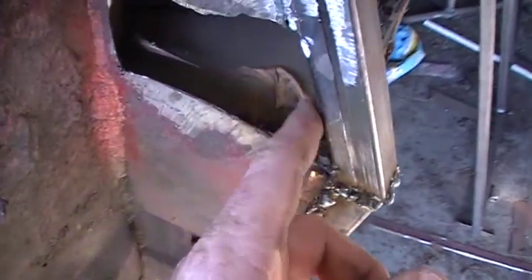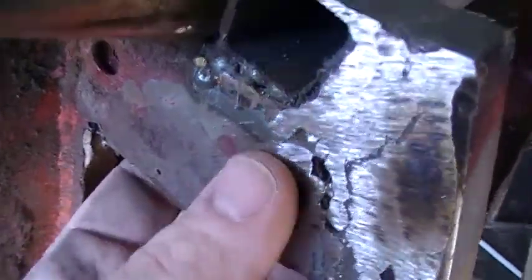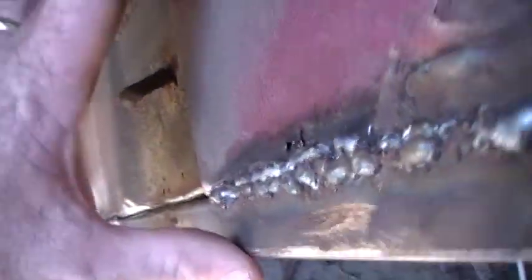Back here — you've seen before — I cut this rust out. It was a small hole that wound up being this big. I'll definitely get some more metal and fill this in. The back side of here doesn't feel totally solid, so for my peace of mind I'll either get that completely out or at least support and secure it from behind. I'm gonna run bolts through there. I bought my new rear end and I'm boxing this in, so there's gonna be tube here — I'm gonna grind that down so this entire rear section is boxed in.